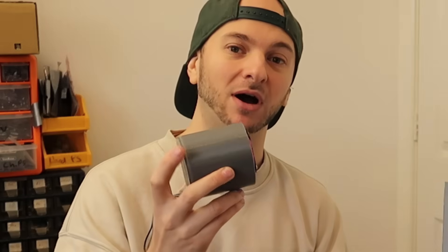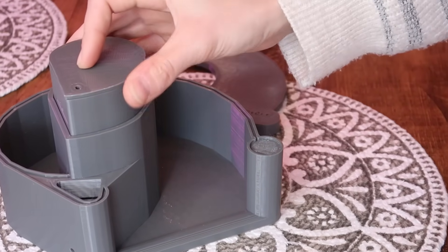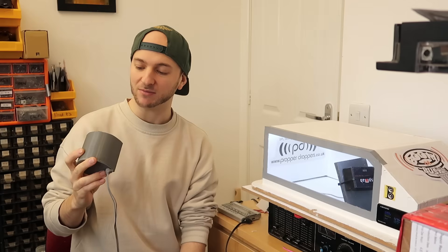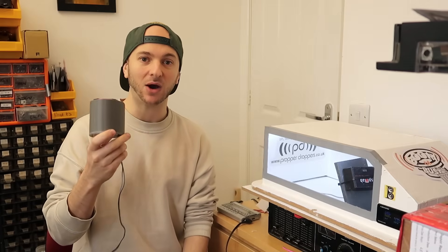What we have here, by convenience, is this sealed box — the sealed chamber from the Fibonacci 4th. This was the little sealed side of the 4th order, that stuck down into the horn-expanding mouth of the Fibonacci 4th. So it made sense to give this a go; it's the right kind of size that we want to test with, and we can run some parameters on it so you could model it and make predictions of how it would change if it was slightly bigger or slightly smaller. I'm not going to run stuffing inside the box — stuffing makes the box seem slightly larger as far as the driver is concerned, at a slight loss of output — we're just going to go raw and empty to see how it fares.